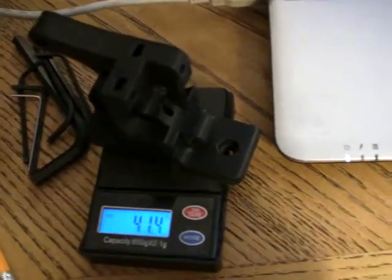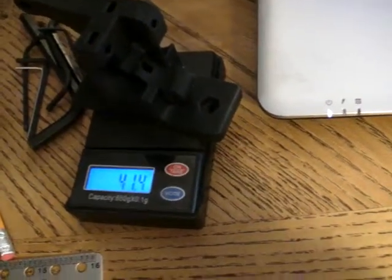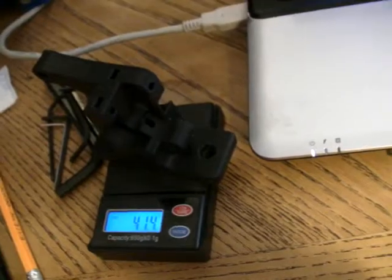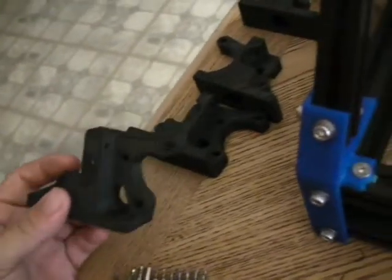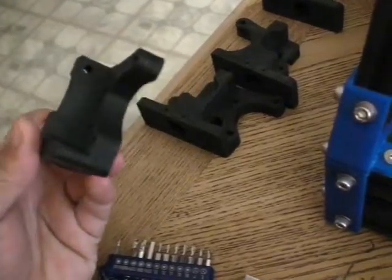The next one I printed, I set the infill to 75%. I slowed the feed rate down to 90%. The acceleration is set to 1400. This part feels so much thicker and better — like American made. I also have a couple of them here that are different because I had the Y axis reversed, but it was kind of neat to print them off with the Y axis reversed and then normalized — gives a different perspective on things.